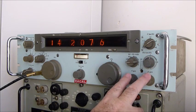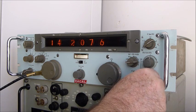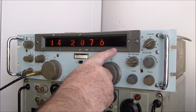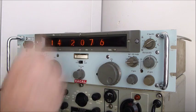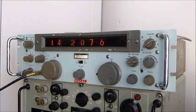The other two controls under here are the RF gain, which with AGC on is not effective, and of course there's the normal audio gain on the right. Right in the middle there's a little fine tune, and there's an extra button on the digital dial which gives 10 Hz steps so you can adjust around a little bit — probably more useful for data modes and tuning in FSK. On the very left there's an RF attenuator of 10 dB, pretty much a requirement for some of the heavier incoming signals.